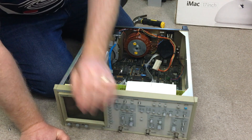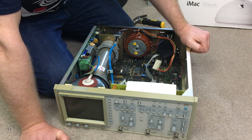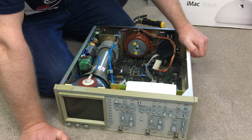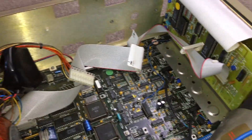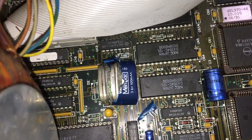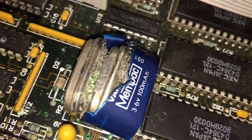And bang — it emitted a load of grey smoke before it even had a chance to boot up the operating system. I killed it straight away; it didn't even have time to boot. We took it apart and I looked at all the caps and everything but could not find a thing wrong with them. Then I looked at the battery. Here we have the interior of the scope — that's the CRT and there's the battery. I've taken the case off and it's a mess. I'm not 100% sure it's that which blew and made all the smoke, but as everything else looks clean, I'd say that's the suspect.